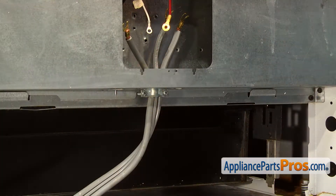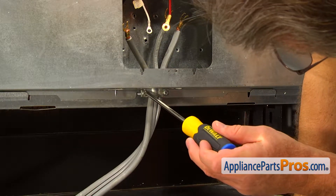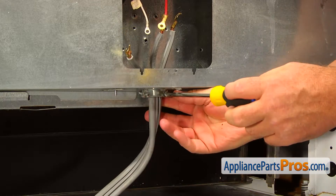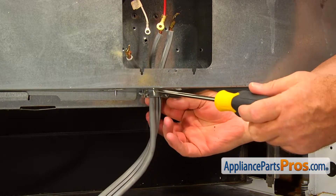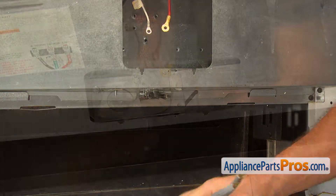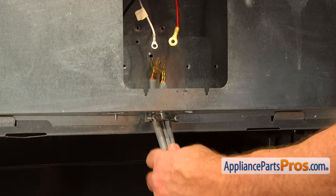Here's what you need to do if you are going to replace the old power cord. Loosen up two Phillips screws at the bottom and pull the old power cord out. Then place the new power cord through the restrictor and tighten both Phillips screws up.